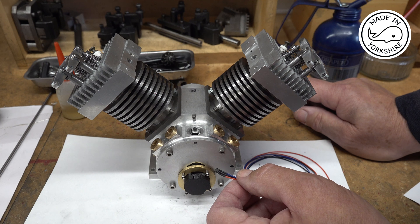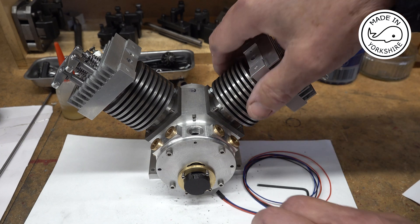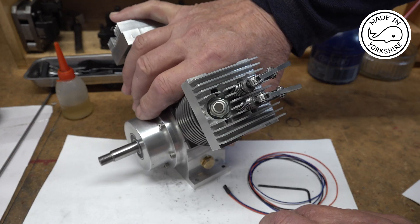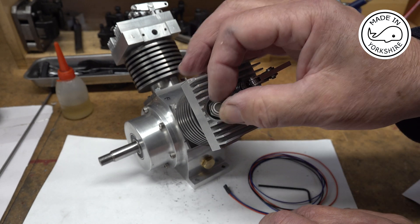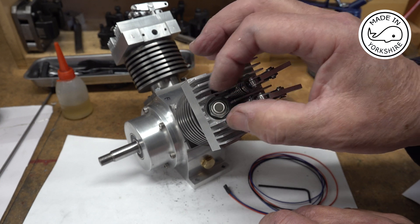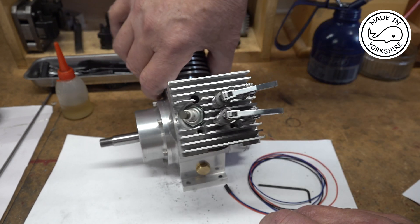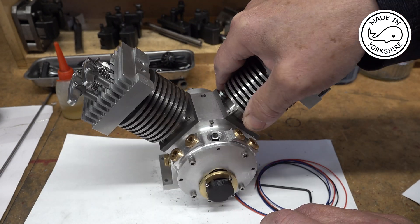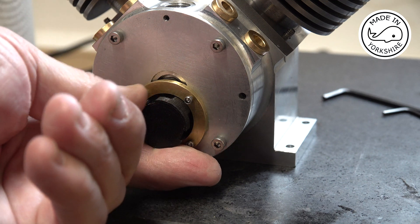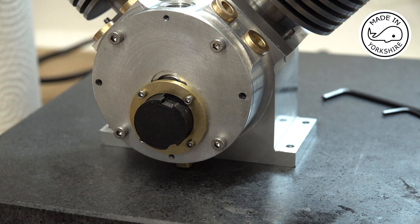So that's the plan. I've just sent an enquiry out to Mini Mag, based in Isle of Wight, and just asked them about the HT connections, because when I've purchased them previously I've had different sorts of spark plugs. I just want to make sure the alligator clip will fit with these particular spark plugs. And I've just bolted this cover down — as you can see, you can advance and retard the ignition using that method. So it all seems to be coming together okay, and it's turning inside without any issues.